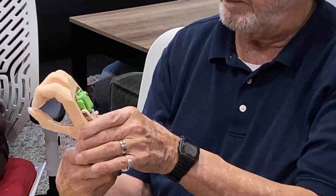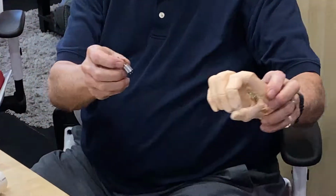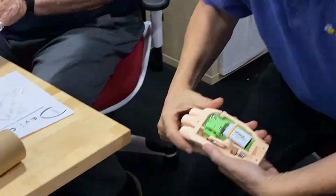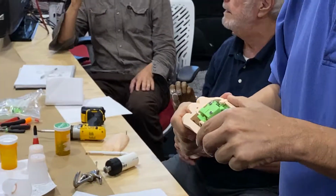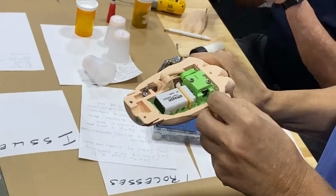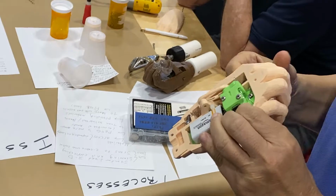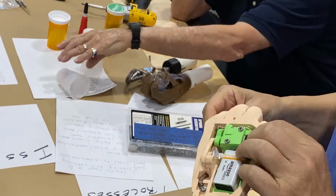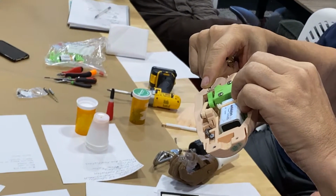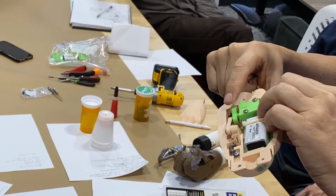And so I'd like to pass this around or walk around with it, John, and let people see it up close. So let me just tell you what to look for. There's a cam which does 2 interesting things. One, of course, is it moves the thumb. The other is it comes around and pushes this little pole apart. The pole is part of the stay-on circuit.